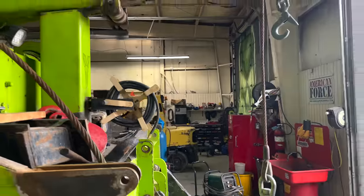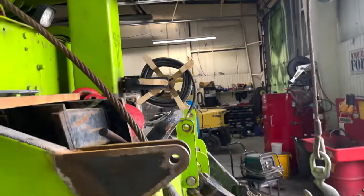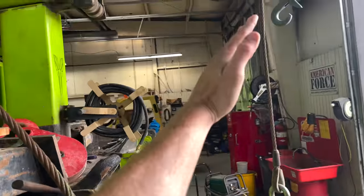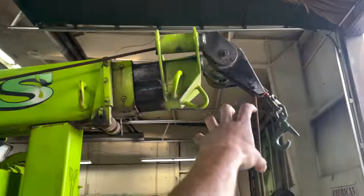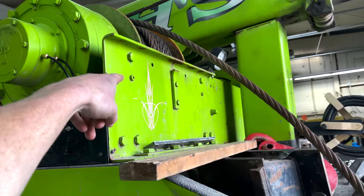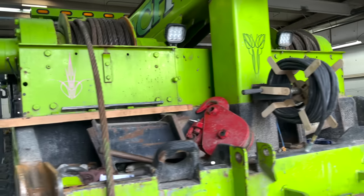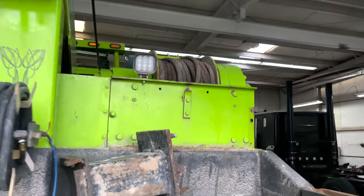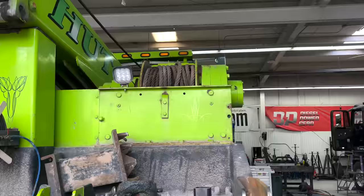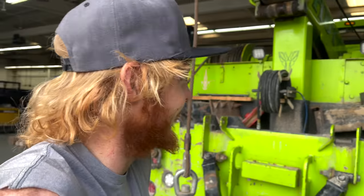And to make it clear, these cables coming down, it's gonna jut up at like a 60 degree angle and then hold the eyelet up here and then also frame back to the actual plate that the winch is mounted to. And it's just gonna be angled as much as I can and just get as much strength out of it as I can, because it's gonna have to hold up against a ton of leverage and a ton of force that those big winches are gonna be putting on it. Because I'm sure we're gonna hook up to some extremely heavy things.